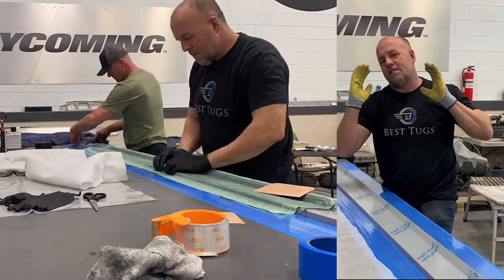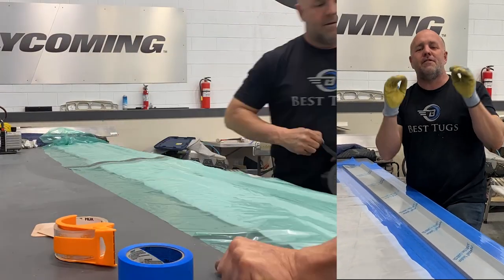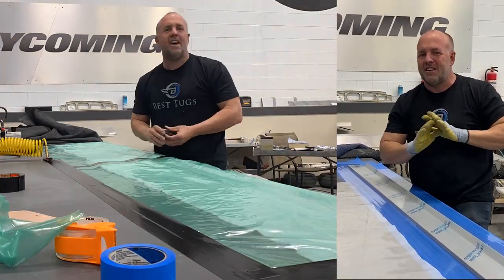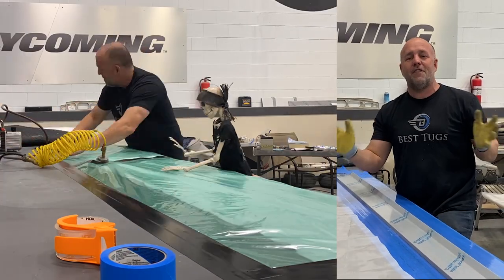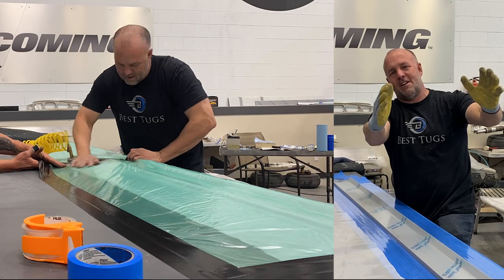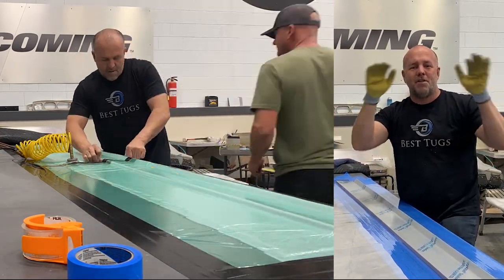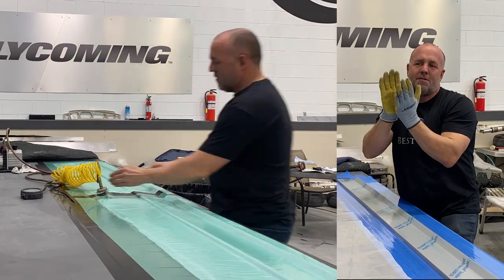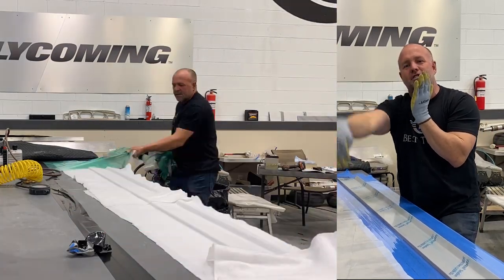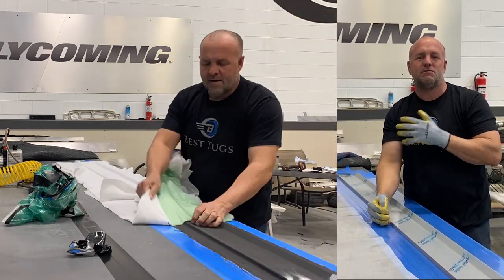Any air that goes in the front two inlets on Scrappy, I want every bit of it to only go between the cylinders and not escape anywhere else in the aircraft, as that would cause air that jumps from the upper deck pressure plenum as the air comes in. If it leaked like rubber baffles that are on some engines, if it opened up and you got upper deck pressure to the lower deck, you're causing the air to bypass the cylinders, which gives you hot cylinders.